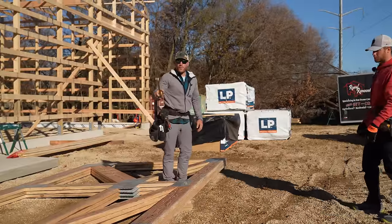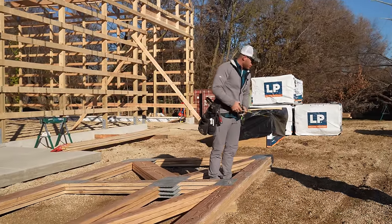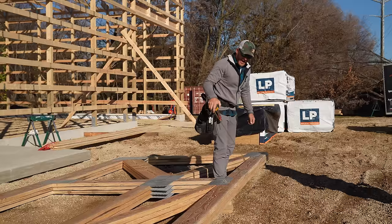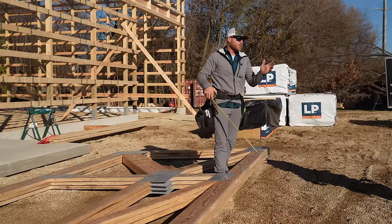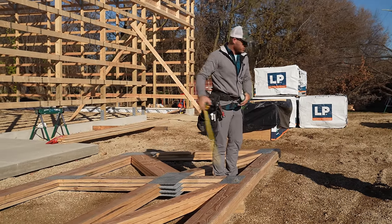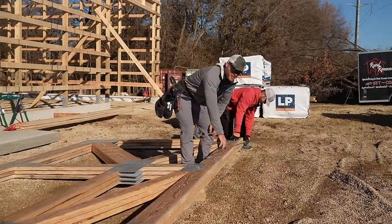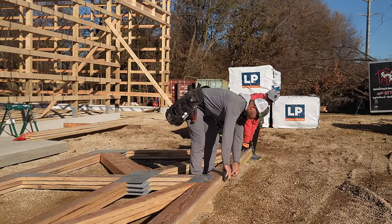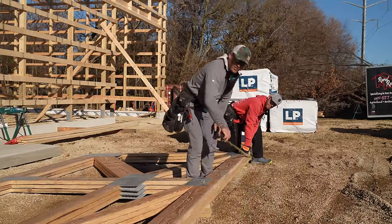Okay. All right, before we get ahead of ourselves and fly this big girder up in the air, which I really wanna do, I wanted to make sure we took time to lay out all of our truss locations on the top of it, where those are gonna land. And I thought about doing the floor joists, but that's too far ahead. We've got a column and we've got a shed dormer roof line that starts at 6 foot edge from our current post. And I just wanted to double check.